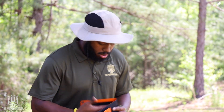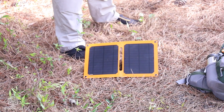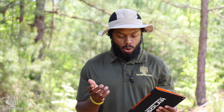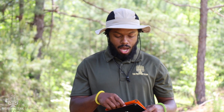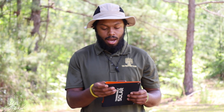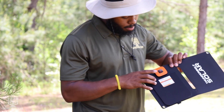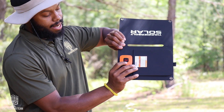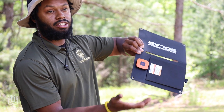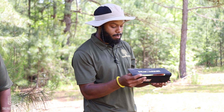You can stand it up just like that to get a good angle. Another thing about this one: it's only nine watts and puts out about 1.5 amps, which is not really that strong, mainly because it's only a two-panel charger — it's pretty much made to be compact. Another good feature is it has a digital reader on the back. When you open it up, it shows you the exact amount of watts it's putting out. If it's not in good sunlight, it'll show a lesser number; in good sunlight it'll show the full output.